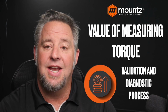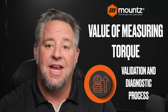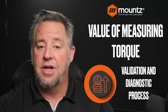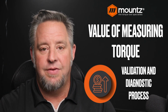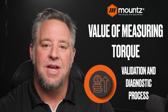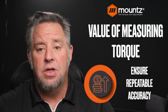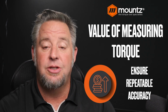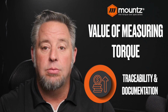We'll also look at the value of validating and diagnosing any type of process failure or problems with process assembly instructions. If we have the ability to measure what is happening with the assembly, we can take a better look at that. We can ensure that the tool that we're testing is repeatable and accurate. Those are two separate things, and we'll touch on that as well.